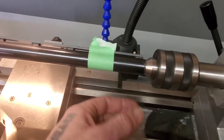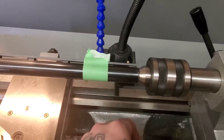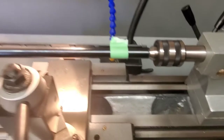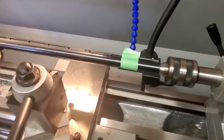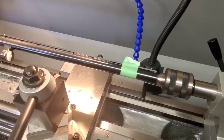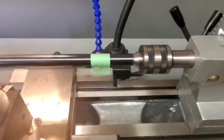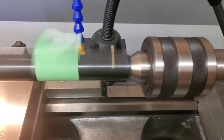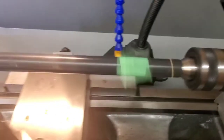So I've got this portion internally indicated, and I'll show you what that does. You'd be surprised how shotgun barrels and some rifle barrels are, but I'll turn this dude on and you will see how, I guess, not straight the barrel is. So you can see right here, it's nice and straight, spinning concentric, and that's just the OD showing.